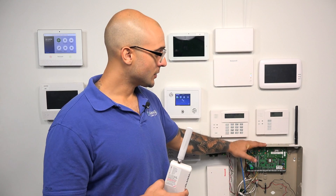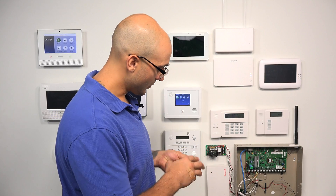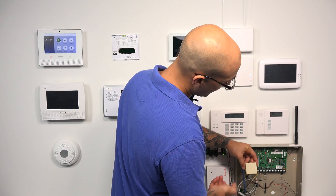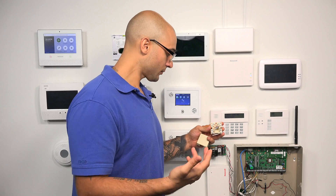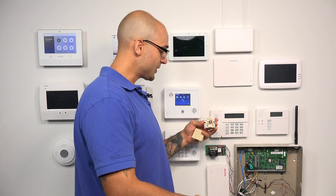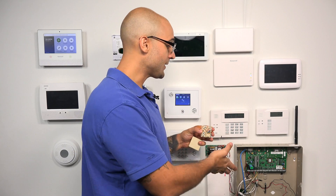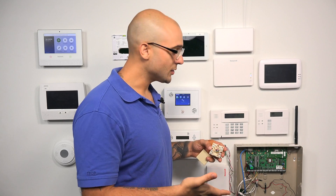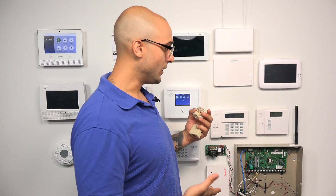If you have a VISTA panel or an older alarm system installed, there's a good chance you have an RJ connector installed. I have one right here — it's going to be mounted somewhere near your alarm system on the wall, and inside there's a whole bunch of terminals. What the RJ does is allow the phone line coming into the house to go into the RJ, then out to the alarm system, and then back to the RJ, and out into the house. This lets the RJ cut the line to the house when the alarm system needs to communicate, so the system can actually speak out without being interrupted by someone picking up the house phone.